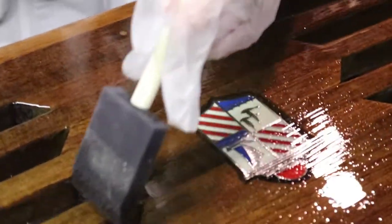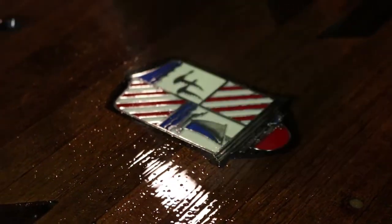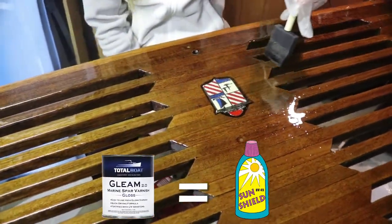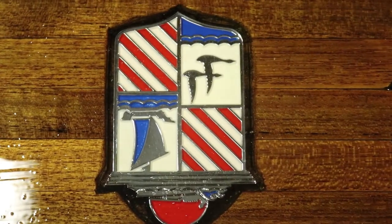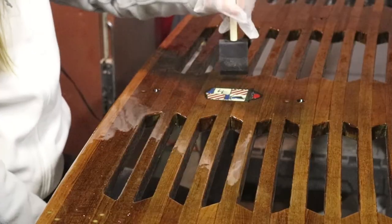Let's take a quick look at the Chris-Craft emblem we put in the platform a few weeks ago. We grooved the area around it just enough that the emblem should get a little more varnish than everywhere else. Think of varnish like sunscreen for wood — you never want just one layer, you want to put several on. We really want the colors in this emblem to stay vibrant instead of fading away in the sun. So we're looking for as much UV protection as we can get.